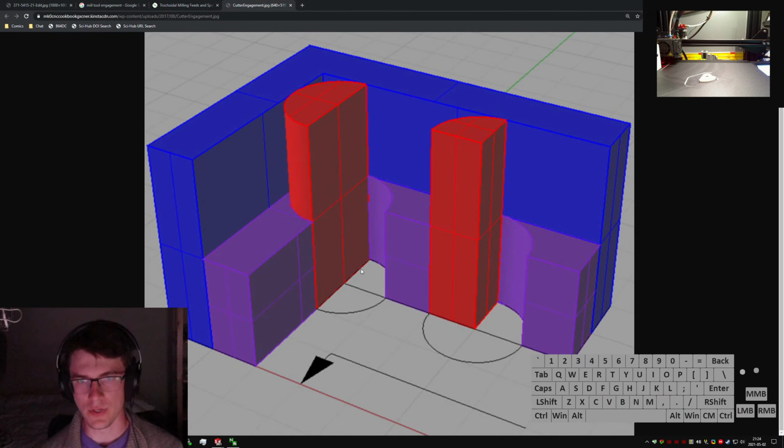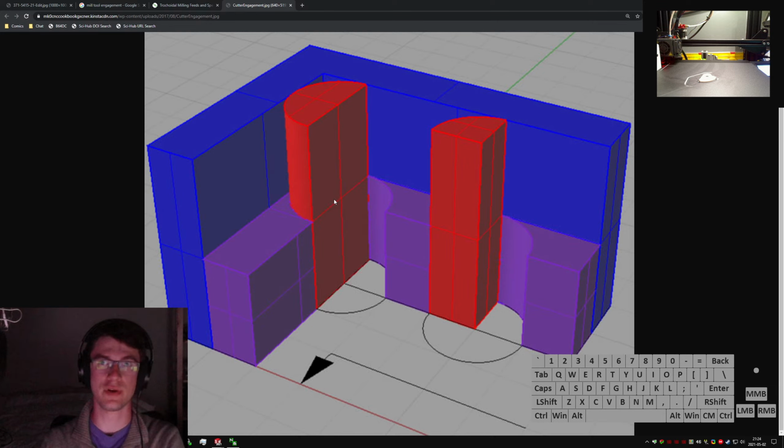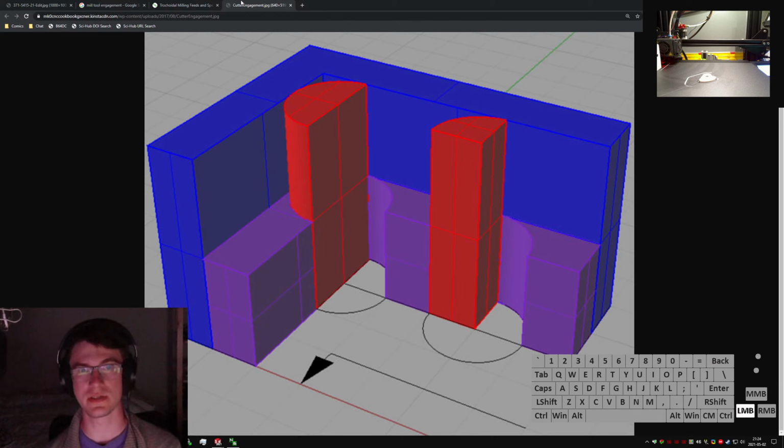So when you get the cutter all the way into this corner pocket here, you're going to get terrible surface finish on the inside. So if you just accept that that can be 0.51 or 0.52 instead of dead nuts 0.5, they can use a 1/2 inch cutter. They don't have to go down to a 3/8 or even a quarter if you have other features that are useful for those sizes. And you can mill a lot faster and still get nice surface finishes, which saves your programmer's time, it saves you machining time, you get faster turnaround on your parts if you design them to be more manufacturable.